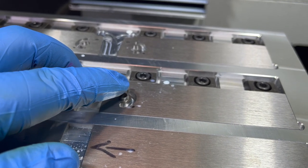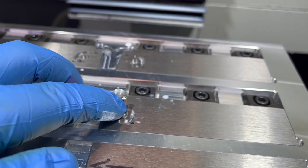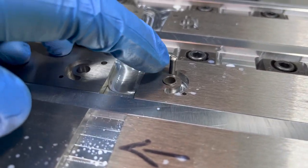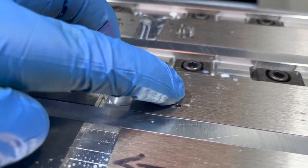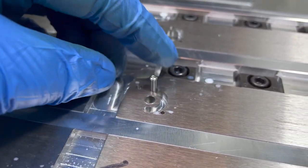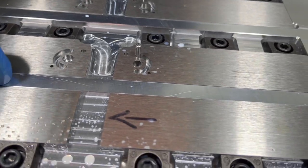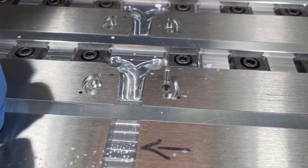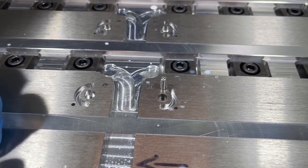The bushing is just nice. Push it down in there. So it's even in there that far, and you still got to push it the rest of the way. So just a nice fit on that reamed hole. The 1/8 feels good. So I'll get out there and I'll measure a ball bearing over this reamed hole right here, and then we should be good.